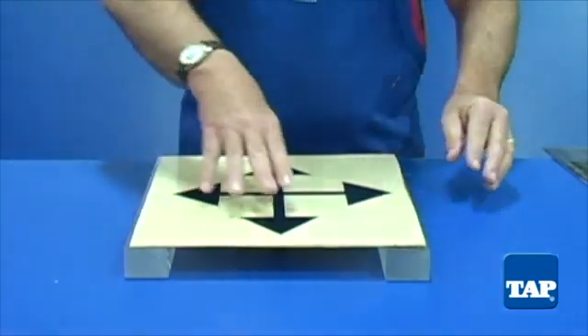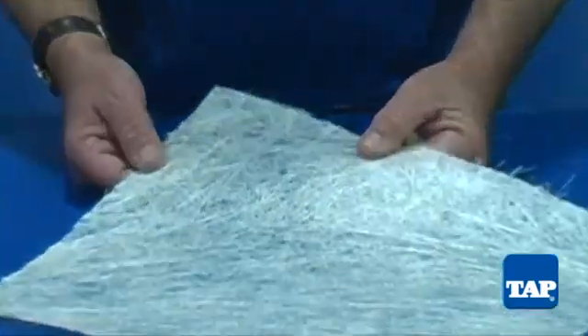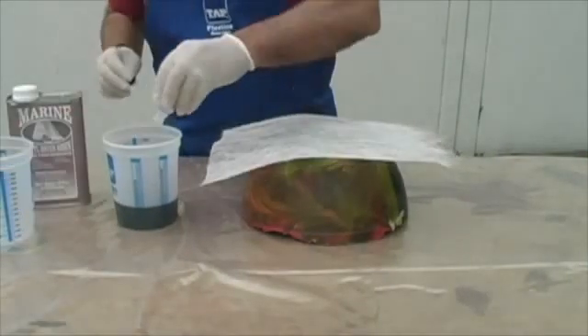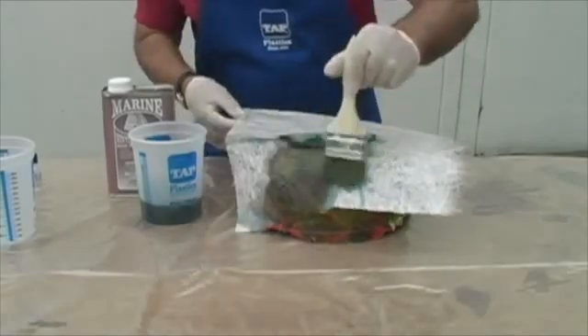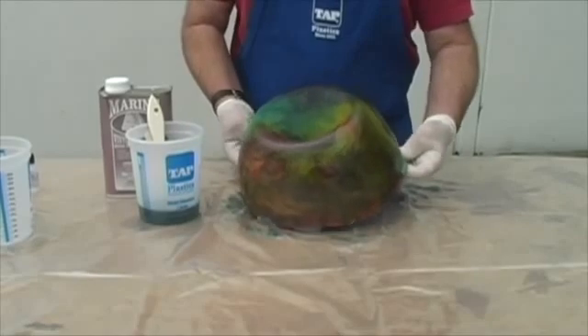Now take this piece of material. Its fibers are going 0 and 90 degrees. It is strong in this direction and in this direction because of the bidirectional strands. Here we have a fabric called mat. Notice that its fibers go every direction — it provides equal strength in all directions. Therefore, it is omnidirectional. It is almost always used in conjunction with a cloth for maximum strength. One of the special characteristics of mat is its ability to conform to compound curves and complex shapes. These fibers are held together with a glue that dissolves in polyester resin. When that happens, the fibers behave like paper mache and conform to shapes that most cloth could not do.